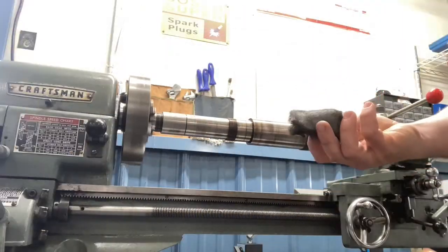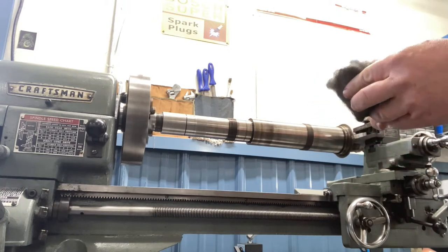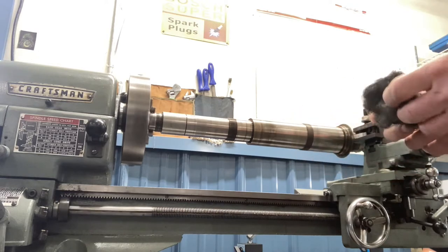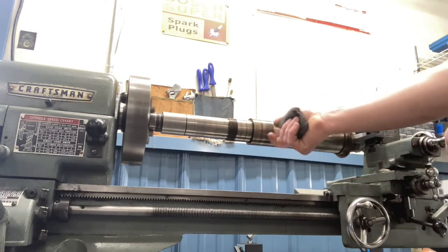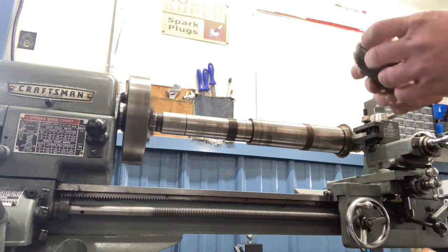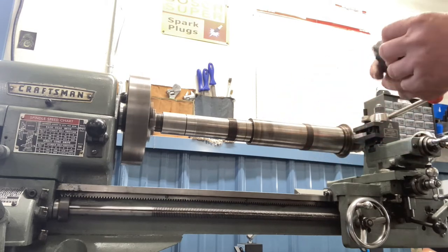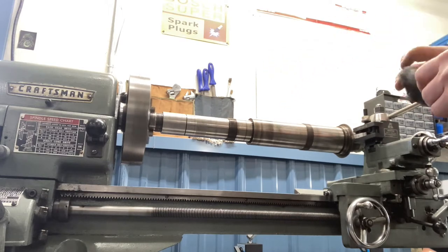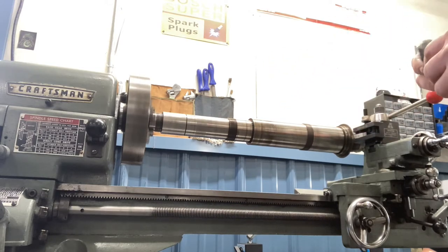One thing when I'm polishing on the lathe - I don't want to get anything that's gonna wrap around or pull my fingers in. I've seen some people get bit on their thumb using an emery cloth wrapped around and pinching it, and it pulls them in. So I'm just going to basically fold up the steel wool and apply some pressure with my hand up above where I'm polishing, and that's a pretty safe way to do it.